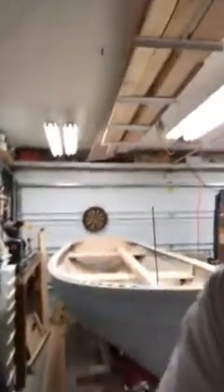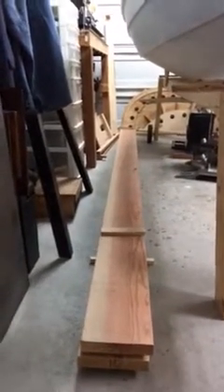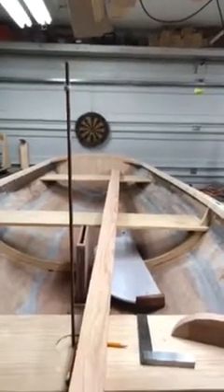Today I'm going to work on my mast — I've got most of the bow parts done. The way the plans show you to start the mast is you take a couple of two-by-eights, clear lumber. What you do is glue them together one on top of the other, and I clamped it all along the length.